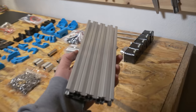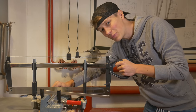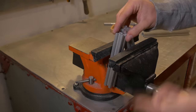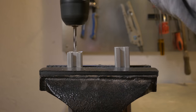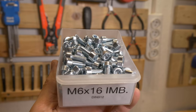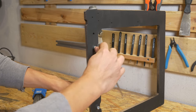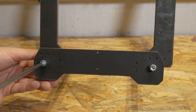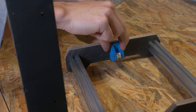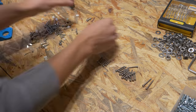The first thing to do is to cut the aluminum profiles to the proper length. Cutting them with a saw reminds me of how I built the Dremel CNC. I decided to go with 20x20mm aluminum profiles because I have plenty left from building the Dremel CNC. On the original Prusa i3 there are actually 30x30mm aluminum profiles so the construction is a lot stiffer, but I have plenty of the 20x20 so it works for me. I also reused a lot of screws from the previous printer and sorted them to make assembly easier.